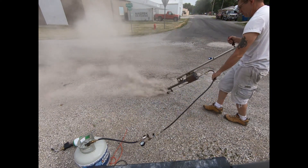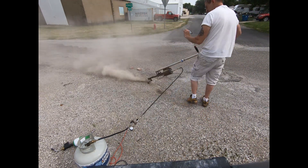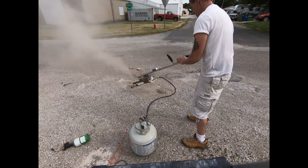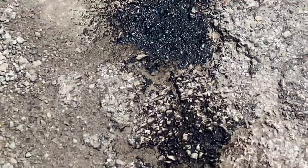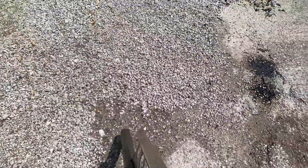For a review: this is what an asphalt heat lance is — a tool used by parking lot companies and people who do repair jobs on asphalt. If you have a big crack in your parking lot with grass growing through it or full of water and you're there to seal it, this thing will vaporize all the water, blow all the grass and dirt out of the cracks, and can even ablate the surface and rip up old chunks of asphalt. You get a lot of heat and air pressure without needing a five-thousand-dollar air compressor.